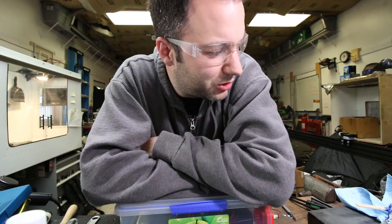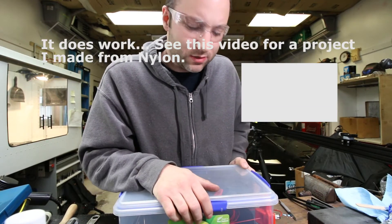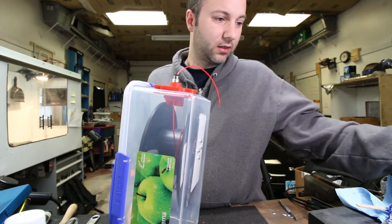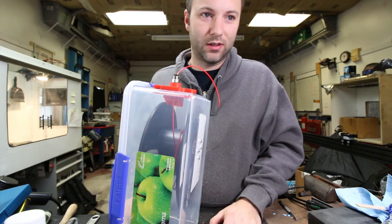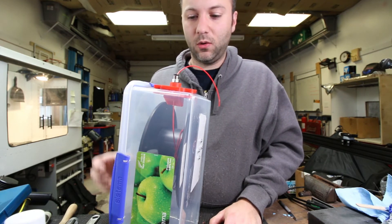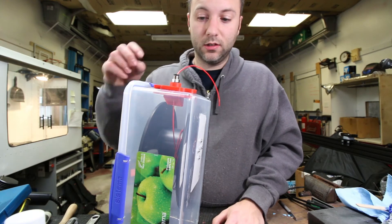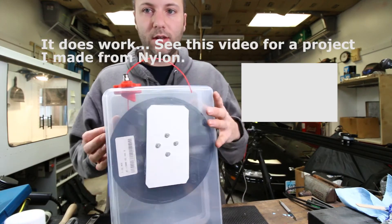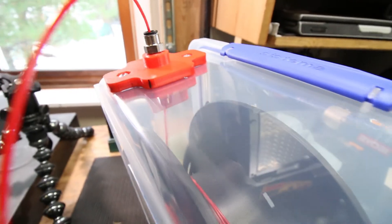So this one got out of hand a little bit — it's supposed to be a simple quick project and it turned into being a little bit of a mess. I think it's still going to work, but I may revisit it. Between cracked plastic and not having the right pipe tap fittings — didn't realize how difficult this was going to be — this is apparently a British pipe thread fitting, and I just thought I could force it in like a self-tapping screw into the ABS plastic. But ABS proved tougher than I thought and the hole was just a little bit too small.